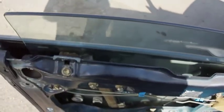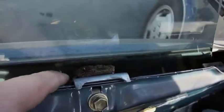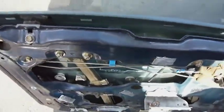Unfortunately for me, my felts right here were pushing all the way against the window, and they were seated all the way in. So what I did, me and a buddy, make sure you have two people, makes things easier, we dropped the window and got a pair of channel locks and squished the felts. They're backed by a little metal piece, so it's a piece of felt on some metal. You bend the metal back and pinch it, put your window back together,